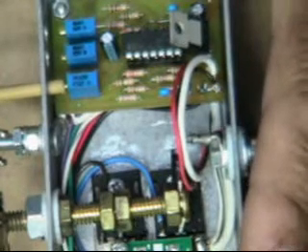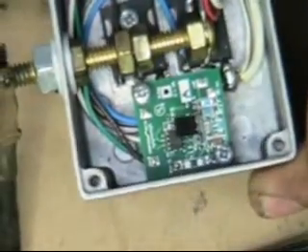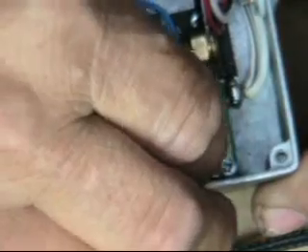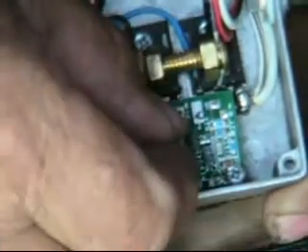Now, I was telling you about a feature on this that Mr. H2O2 from H2O did. It happens to be this little chip right here. It's a jumper — just a little plug and two little pins. This is the bypass for this unit. If you take it off and jump right over, it goes full power. It gives you a little bit of adjustability so you can check things and then take it back off without having to readjust your pots and do all this stuff. You can jumper it out — really a cool thing.